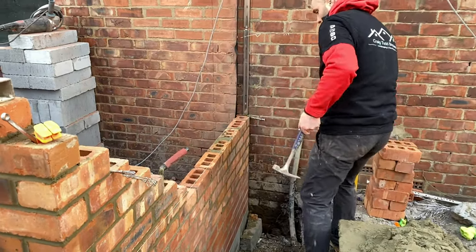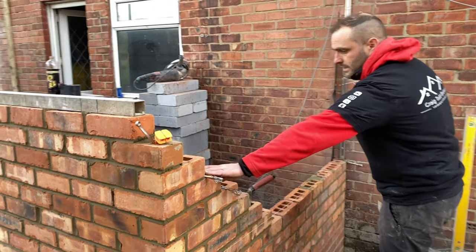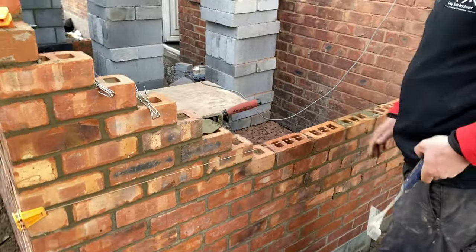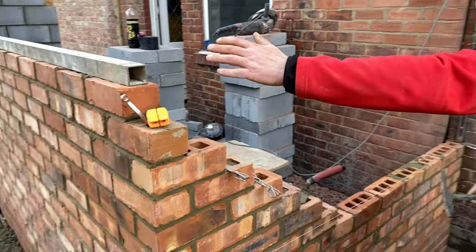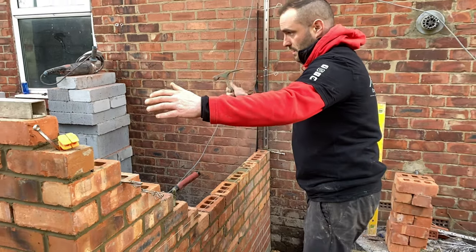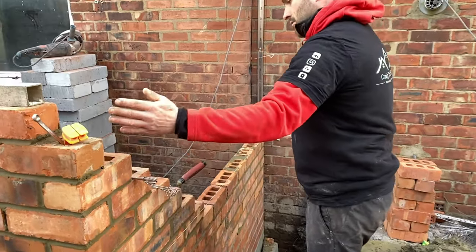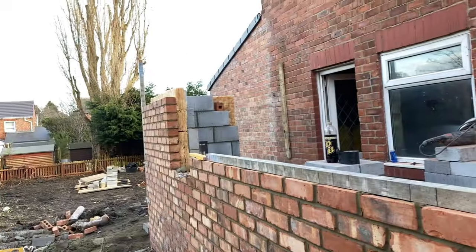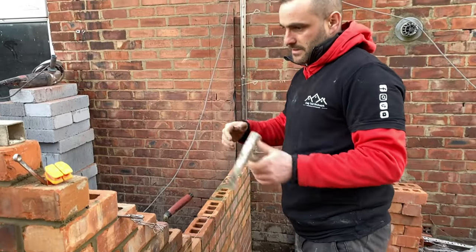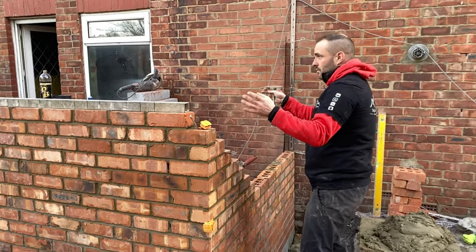Up here to the windowsill height, which is on this course here. So we're going to finish running this brickwork across up to that height, put the profile on, set the window where the brickwork's going to stop and the opening's going to begin. We'll run that brickwork round and then we can then put our corner block back on the other side onto here. We can pin into there and just keep running this gable in up to the window,